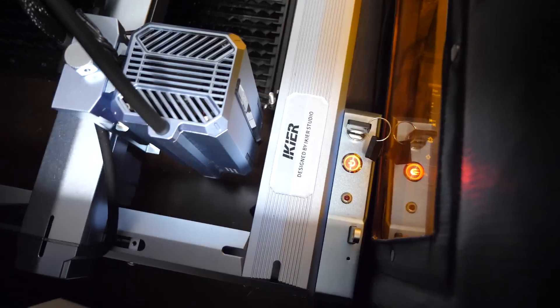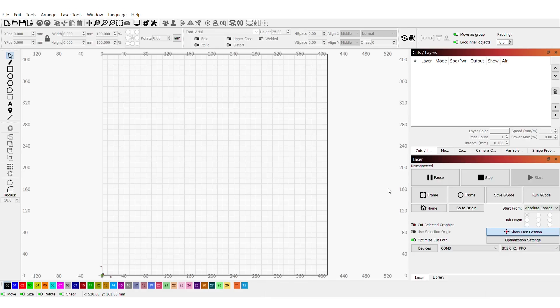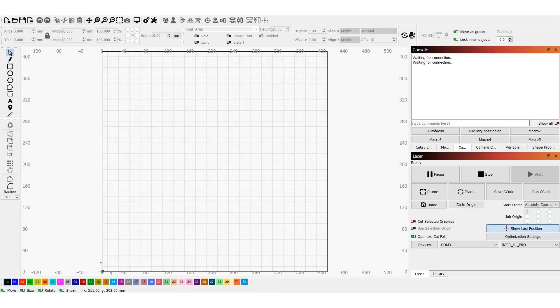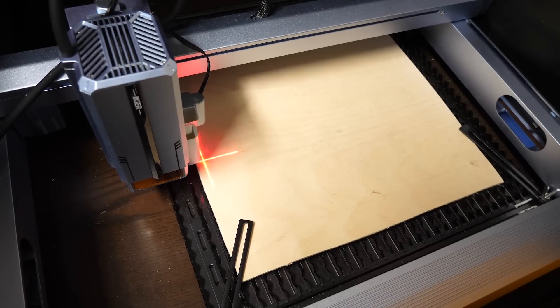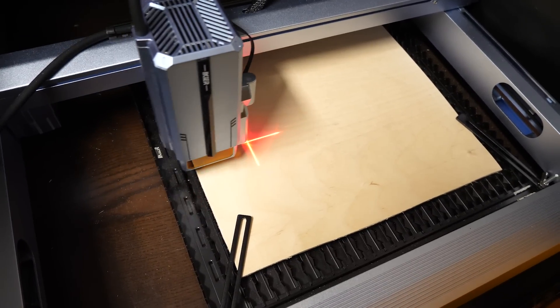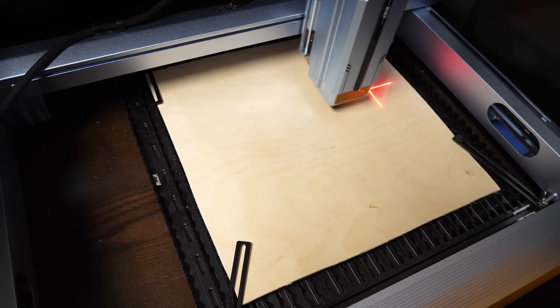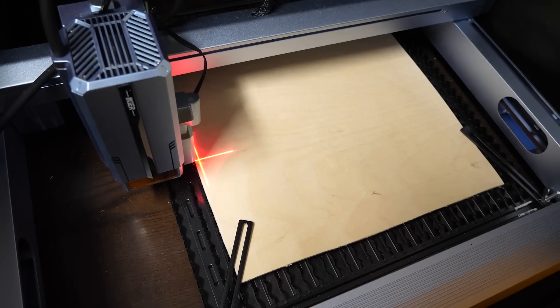So let's fire up the machine! For control I use Lightburn — it is a paid software but it works best for me. The machine has a motorized Z-axis that really helps with focusing. You have to set up a simple script in the app, but then the autofocus process works by itself. It also has a separate crosshair laser positioning guide, which is much more visible than the single dots on other machines and is very useful when we do the framing. Again it takes a bit of tinkering in the app but after that it works flawlessly.